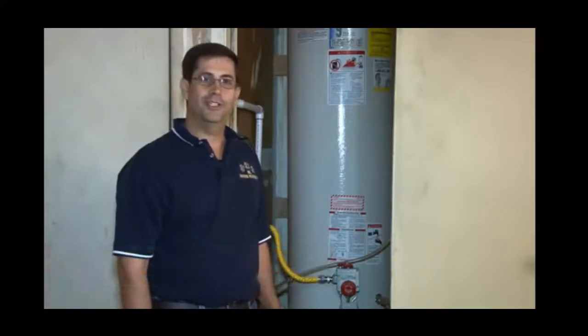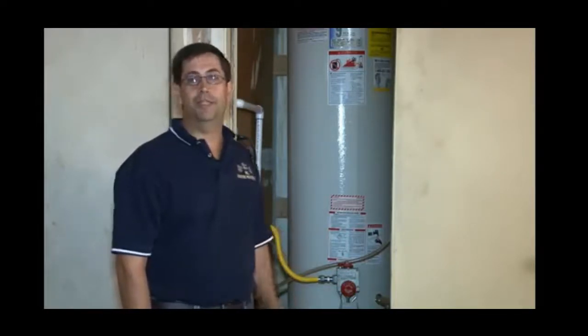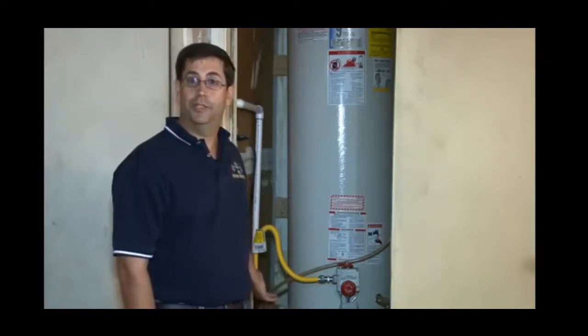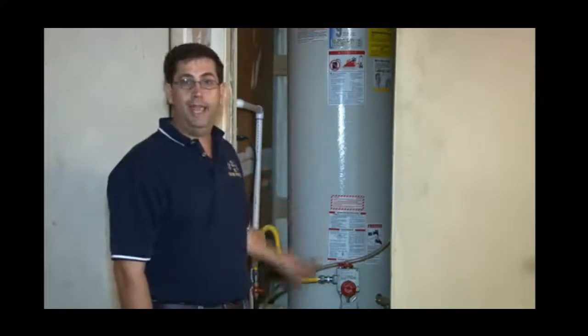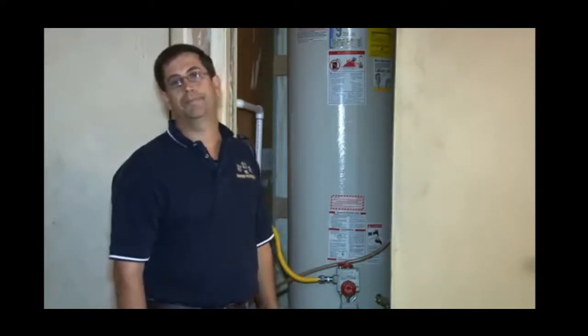Good morning. My name is Jim Brown with W. Brown Plumbing. I've been a plumber for about 25 years. I've been installing Eternal water heaters since about 2006. Today we're going to change out a 40-gallon tank-type water heater and replace it with the Eternal GU100. With the GU100, we don't have to increase the gas piping because the unit runs off of a half-inch gas line. The vent piping just ties in directly, and this unit happens to have a condensate pump already for the air conditioning next door to it. So this should be a very simple swap out. Let's get started.